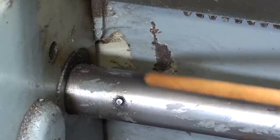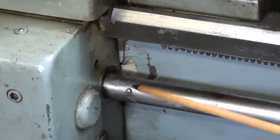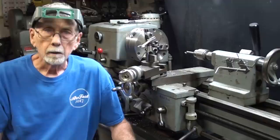Let me zoom in on that. So if you crash the lathe, this brass or aluminum pin will shear — just like an old Evinrude or Johnson motor from the 50's. When this machine was in the high school shop, I used to carry extra shear pins in my apron pocket. They sold them, but I ended up using aluminum welding rod, and that sheared so easily that even a heavy feed — not even a crash — would shear it. So eventually I had to switch to soft brass.